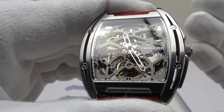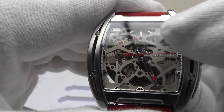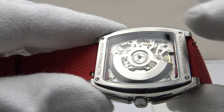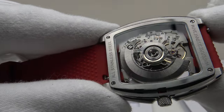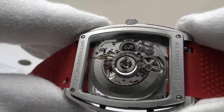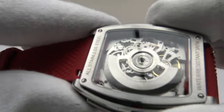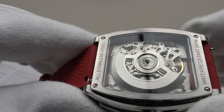The skeletonized bridges of the movement used — the Seagull Caliber ST2553 JK Automatic — are very aesthetically pleasing. It's a nice design and it's nice to be able to look straight through the movement from the sapphire crystal in the front to the mineral crystal in the back. We have an exhibition case back with four screws, and the center section is glazed with mineral crystal. They've skeletonized the rotor which is very aesthetically pleasing, and it is nice to look at the movement both through the front and reverse of the piece. It's an undecorated movement but the skeletonization of the bridges and rotor add interest, and it's nice to be able to see the balance wheel running.